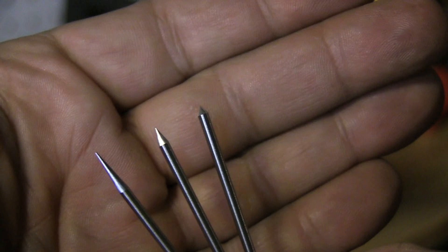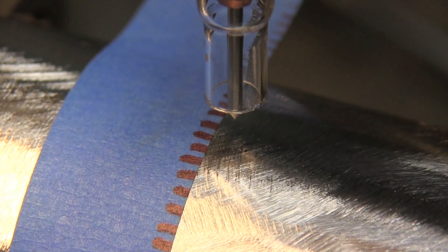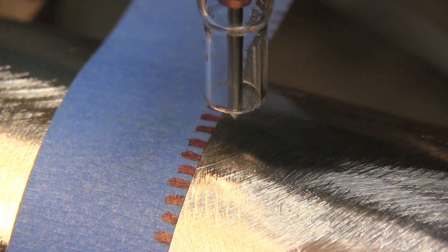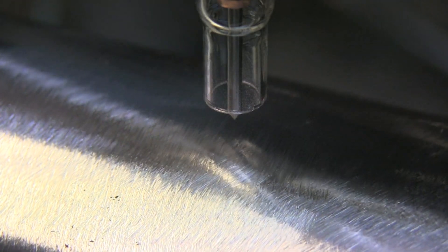I've got three distinctly different tapers here, and we're going to see what each one does. I'm going to gap them the same — make sure they have the same arc gap, same travel speed. I'm going to cool it off completely in between each bead. Even with that blunt tip, I got a pretty nice crisp start because it's a really good finish from the diamond wheel.